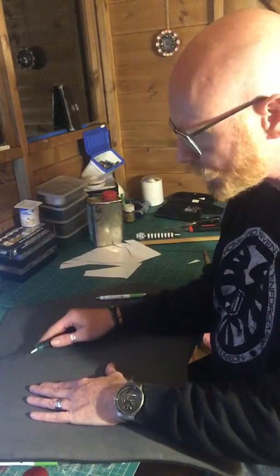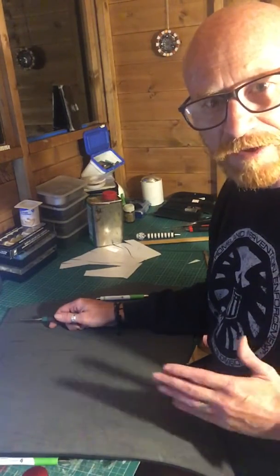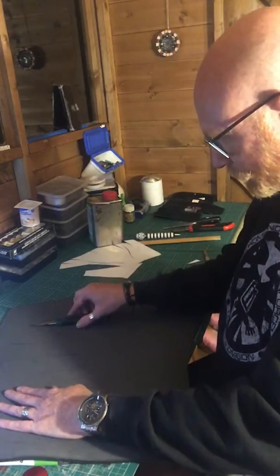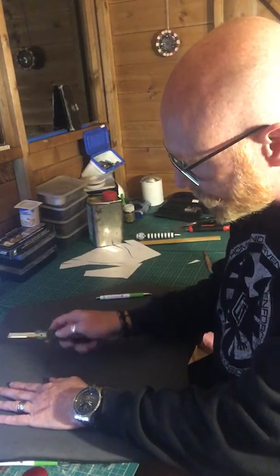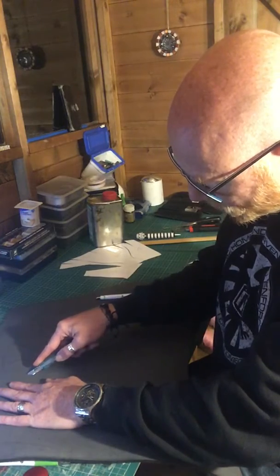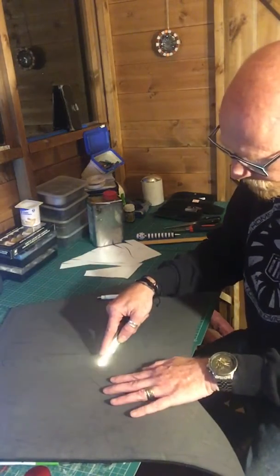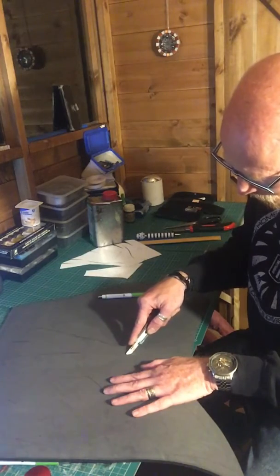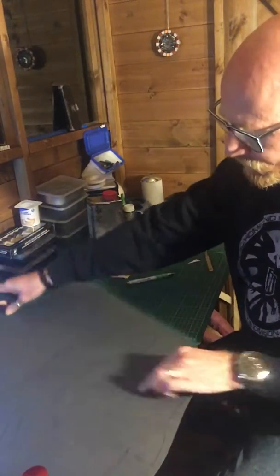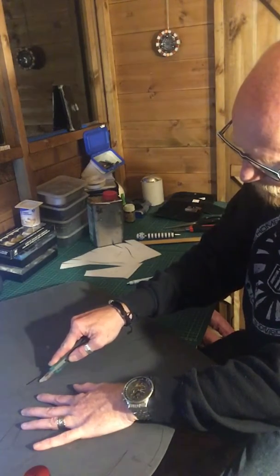Remember, the top part is also going to be 45 degrees out, because I just want it to blend up the leg a little bit rather than cut straight off, again to keep that organic feel. Starting at the top, let's reduce that way down so it won't bend. Okay, so 45 degrees out, bevel all the way around the point. Because I find it easier, I just turn the template around rather than trying to move everything else. So again, 45 degrees out.